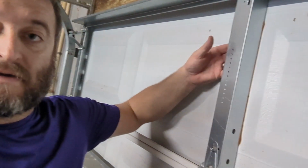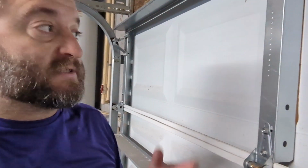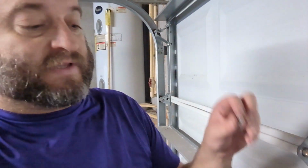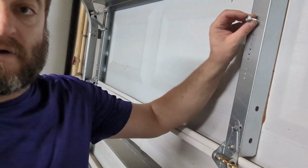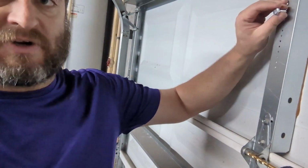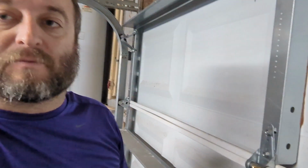So depending on your door, you might need additional bracing on the back here when installing this. And this door does. It's a steel door. It's a heavy door, so they want additional bracing up here. So instead of going in the door with these, I'm going to drill some holes in this, put these through, put an additional bracing bar back here, and push it all together. Give you a little extra strength there, a little durability here. Well, pulling power is good.